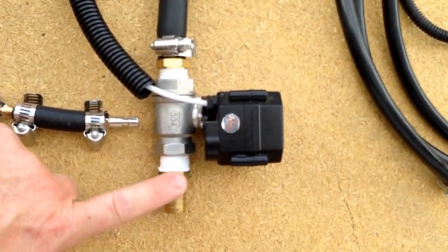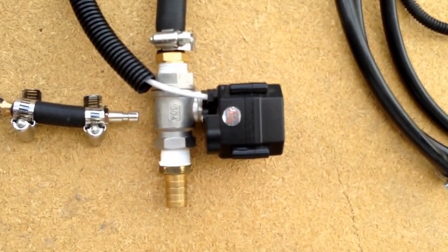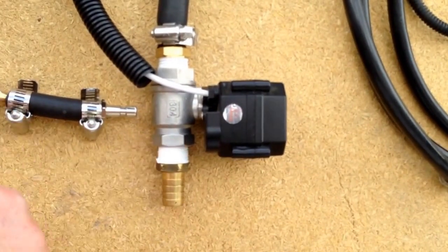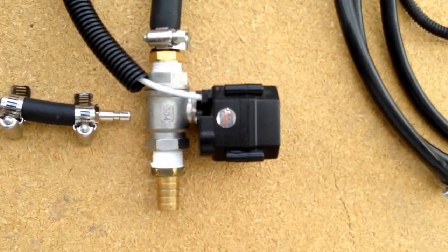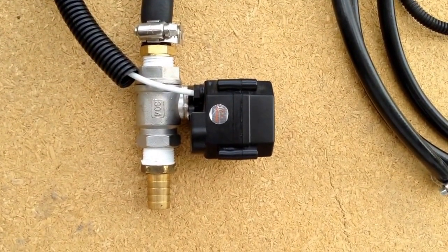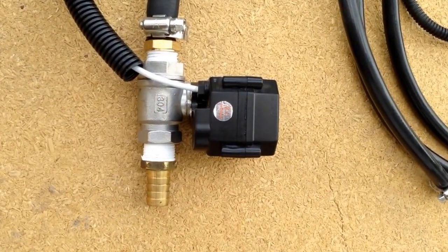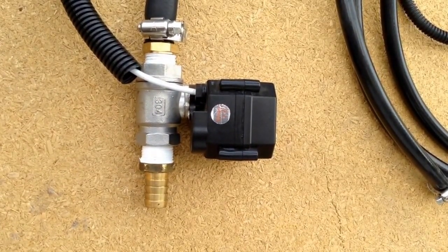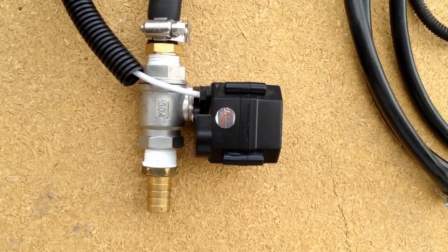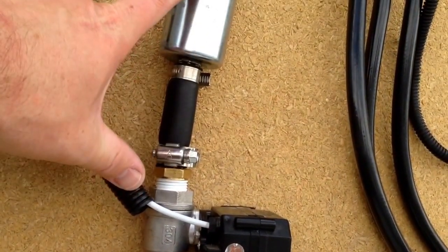Right here is your gas inlet. For this customer it's a hose barb — they're going to connect to it with a gas hose. For most applications you would just run your gas pipe right up to here — threaded gas pipe. This is a standard NPT fitting that screws right in. You can use flexible gas pipe or hard pipe, or you can use a hose barb and use a rubber hose or some sort of composite hose. This comes in different sizes. If you have a really big unit, we can do up to one inch pipe size — just something to discuss with us and we can get you the right one.